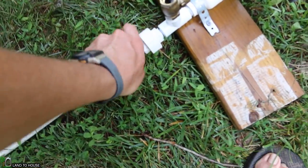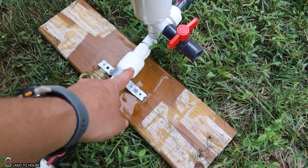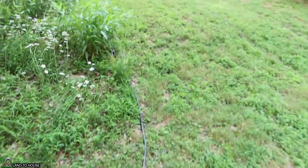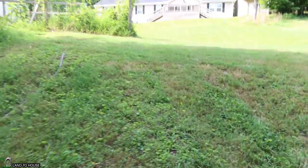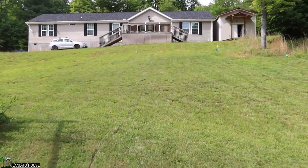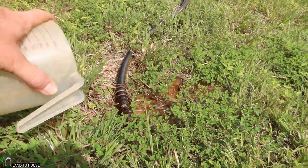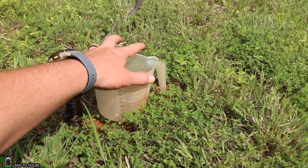Here's the pump itself. If I go ahead and open up the drive pipe, it's going to start cycling the waste valve, sends a pressure wave in here, builds up pressure in the tank, and then sends water uphill. The delivery pipe is already full and water is coming out the top. Let's make our way up and do our timed measurement. I'm going to take this little measuring cup and place it right here, and I'll see how full it gets in a minute.